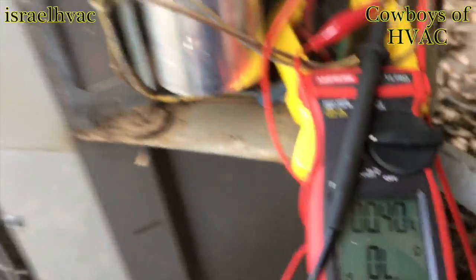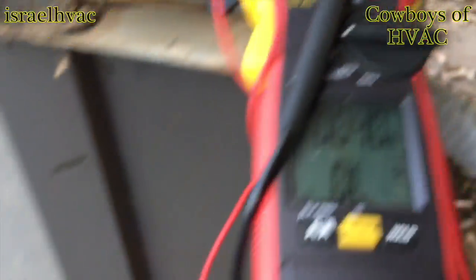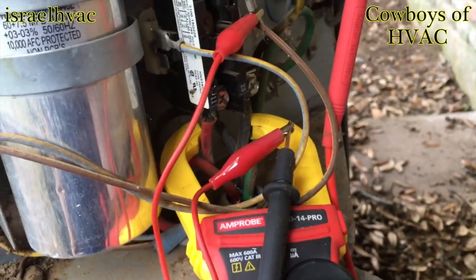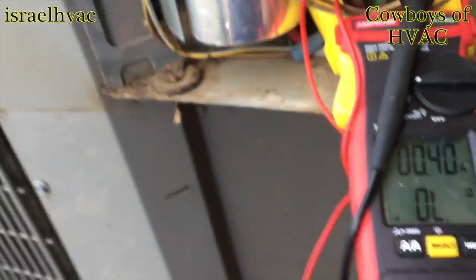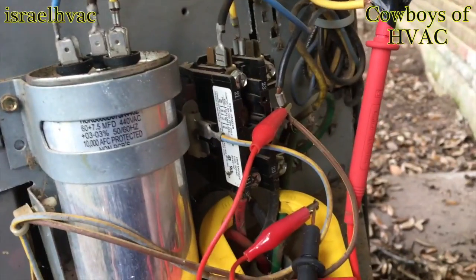The amp probe leads do have a much longer tip, as you can see, but they don't pull apart for alligator clips, so I'm gonna have to get me another set of leads, some Fluke leads, I guess. But I taped that one up and I only had one jumper. I don't know where my other jumper went. So I'm gonna pull the top off of it and cool it off until she kicks out of thermal.